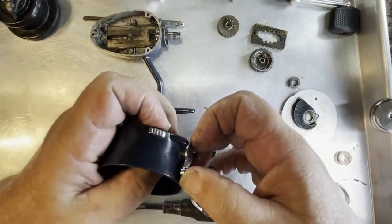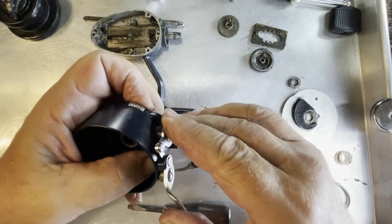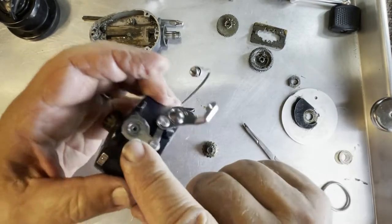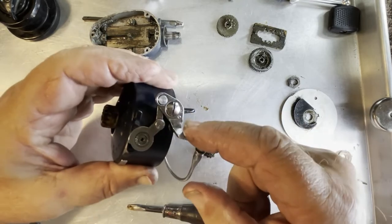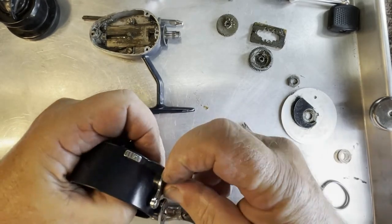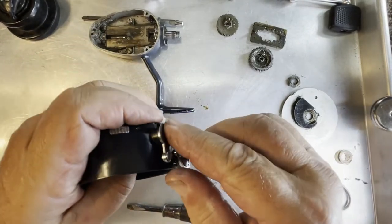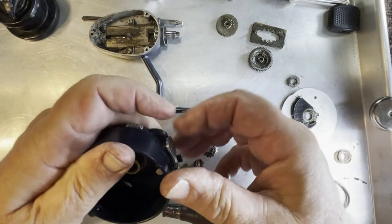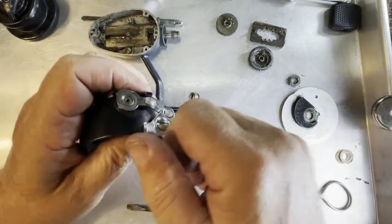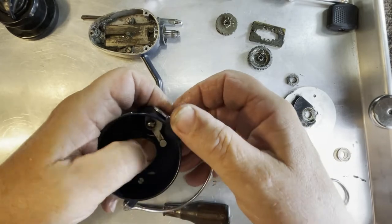So let's go ahead and separate it. Let's see what happens if we throw it that far off. If you don't have the teeth synchronized, then when this comes down it's not going to activate or deactivate, or set the bail. So let's pop that out and see what it takes to get it set properly. To set it properly, move this off just a hair and then take this and set it back in place. Now have we got it right? Yeah, we do have it right. And that's what we ran into up here — you cannot set it with the bail itself, it has to be done with the lever inside.